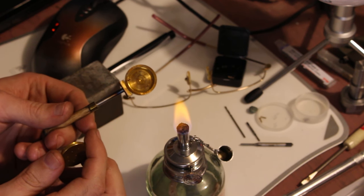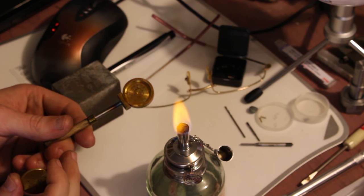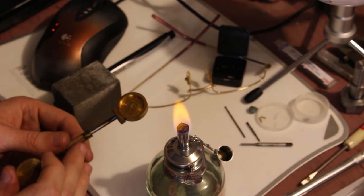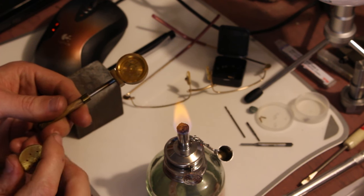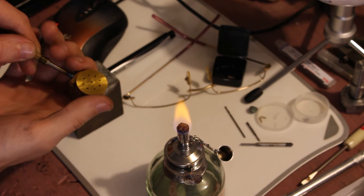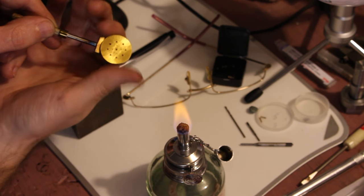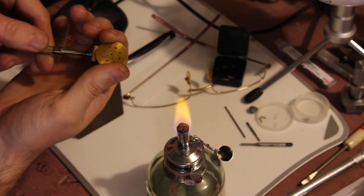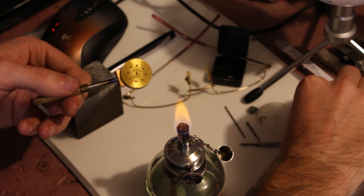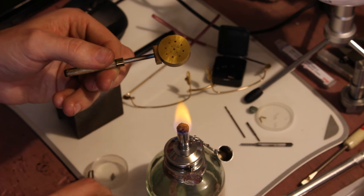The idea is to use it for tempering and bluing very small parts. Open like this, it's a kind of a normal pan that you can fill with brass shavings or whatever you need to distribute the heat around the part that you're treating. But with this lid screwed into it, it makes it really convenient for working with screws. There's an assortment of sizes there for common screw sizes used in small things like watches, or in our case, sunglasses.